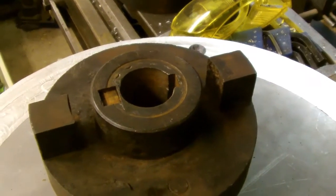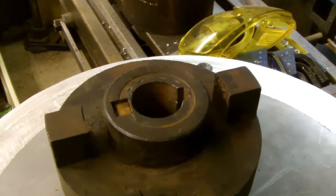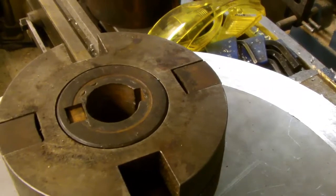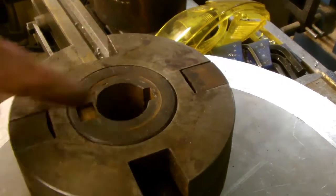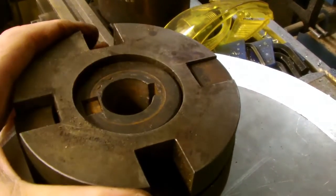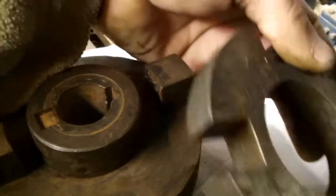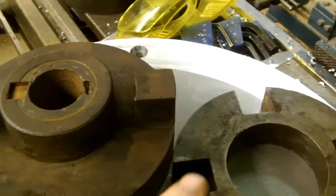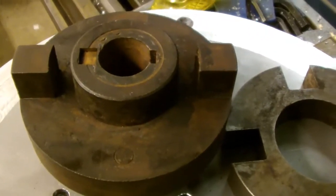The good news is that despite turning the garage upside down, I did actually find the original metal coupling connector. Obviously the lathe dogs fit in there, and this is the one for the motor — one bit of steel where it couples them both. I decided not to use that when I fitted the single phase motor because I wasn't really sure about the alignment, and I didn't know whether I would get them to fit together successfully, so I ended up making a rubber version of this thing, which wasn't the best idea.